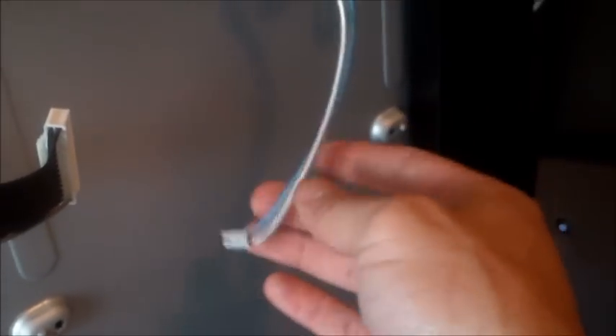When you take off this connector, make sure you pinch it — it unlocks it — and then you pull. So, pinch and then pull. Same thing goes for this one: you want to pinch that so the lever releases, and then pull it out. Don't force anything; double-check your work, make sure all your connections are there. You can mark it with a permanent black marker or take a digital picture, and make sure you have all the things connected to the right spots.